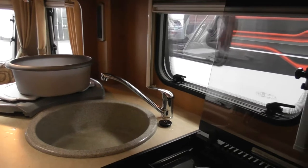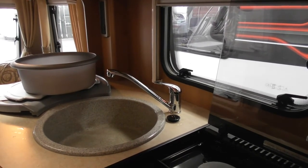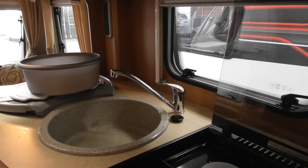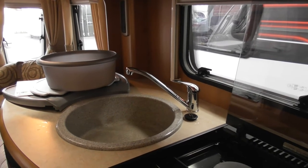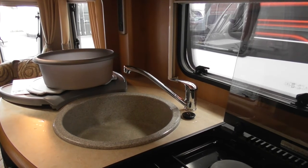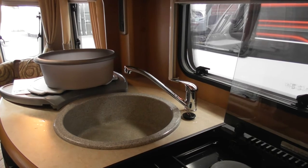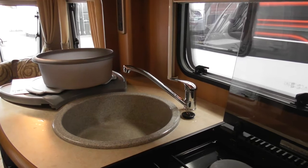So does that carry on pumping and fill that tank up? Yeah, so that's why you hear it running afterwards. What it is, it's pressurising up the system. So as soon as you take any water away, there's a gap in the pressure, then it's refilled by the water coming back through. So you imagine the system's constantly pressurised. Once you've pulled water through in the kitchen, then just move to the back, do it in the bathroom sink, and then do it in the shower. Happy with that? Yeah. Perfect. So what shall I do next?